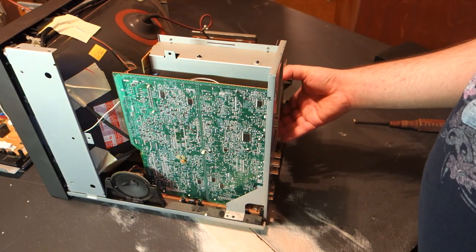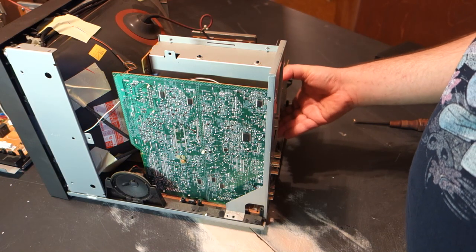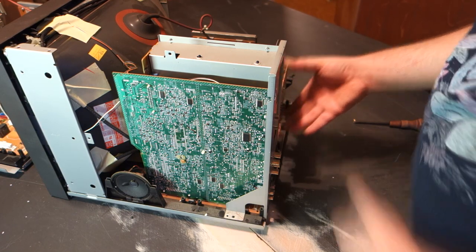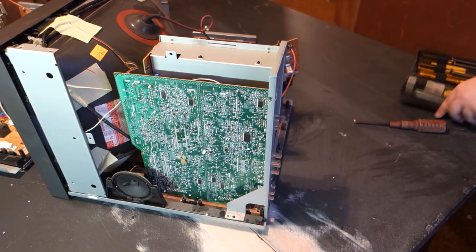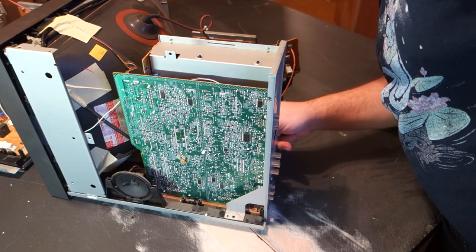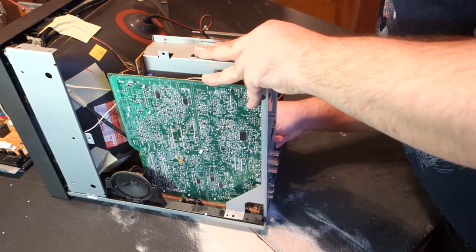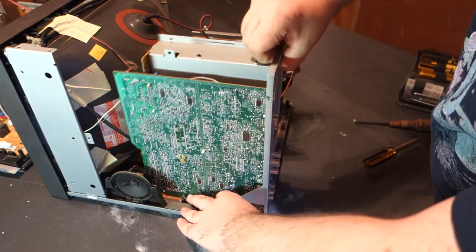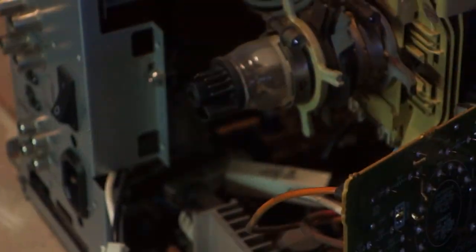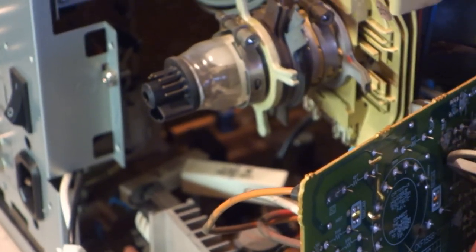While I originally did so here, it would be better to leave the neck board off for now, if only to give ourselves a bit more room to work with in unlatching the connectors going down to the main board. The box for holding the input cards obstructs access a bit compared to the models without it. A flathead screwdriver or simply a flat prying tool of some sort will aid in undoing said latches.